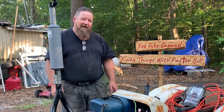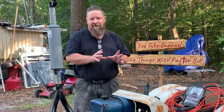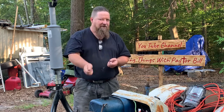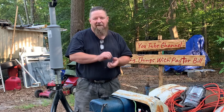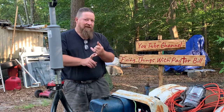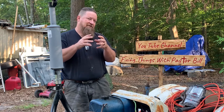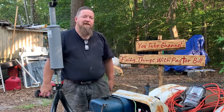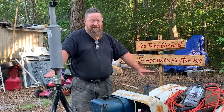Because the clutch... let me make this straight. It has a clutch, but the clutch pedal, we went over it in the last episode. If you haven't seen that, in the very first part of last episode, we looked at the clutch pedal free play and everything, and it goes right to the floor, and it starts to press down the release springs on the clutch plate, and it doesn't go far enough before it bottoms out, and it doesn't release the clutch. So what does that tell me? One, the clutch is probably completely worn out. The fingers on the clutch are probably worn out, and the throwout bearing is probably completely worn out. Because you gotta have all these things working together and making some distance, and there's no free play left. It's run out. But the clutch is still engaged. So today, we're gonna pull this baby apart.